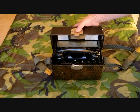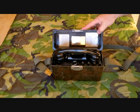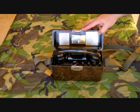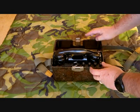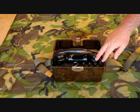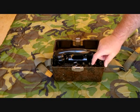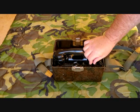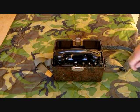We'll go ahead and open it up. Same layout on the inside. It's got the instructions over here to operate the phone in Polish. It's got the schematic over here in Polish and the instructions for connecting up the binding posts. This phone's a little bit different — it's got four binding posts on it. It'll work with a two-wire connection like the TAI-43, with two pieces of field wire running to your distant end, or it can operate with a single piece of field wire and these two connected to a grounding rod or stake. But it's got this fourth binding post on there.